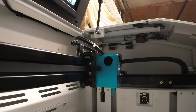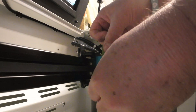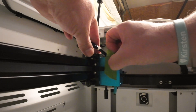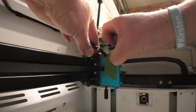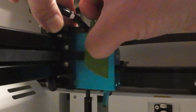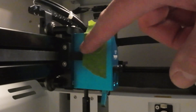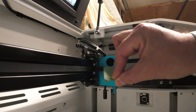Now you need to measure it. When you put your masking tape over the hole, just take a minute, use your fingernail, and try to trace around the hole — the circumference of the hole — because you want to make an impression on the tape. That way when you take the tape off to measure it, you actually have a reference to measure from. You may not be able to see it, but there's an indent around the tape. I'm going to run my pulse test in this position, and when I'm done I'm going to pull that tape off.